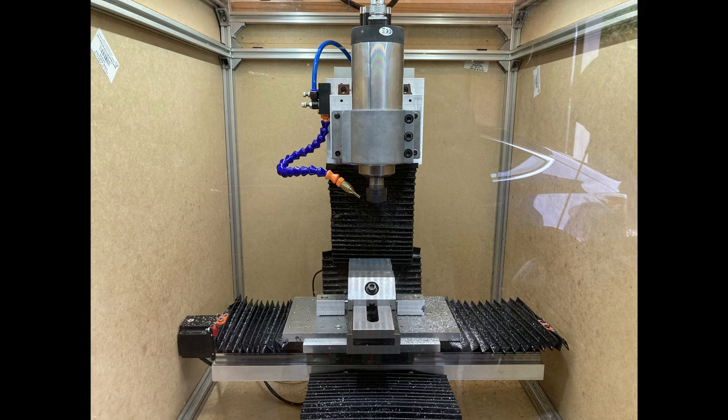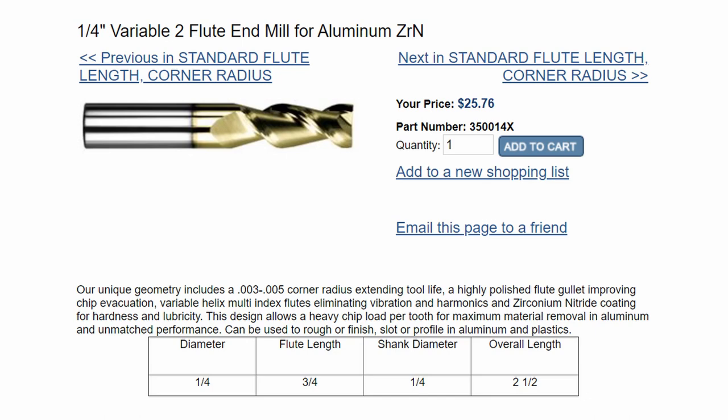I'm also evaluating these cutting fluids only for their effect on the surface finish. The tool I'm using is my quarter inch Lakeshore carbide two-flute end mill. It's made specifically for aluminum, has a ZrN coating and a very slight corner radius to improve durability. I've used a lot of different tools — single flute, three fluted, uncoated highly polished, different coatings — and this is the one that works in pretty much all situations, so that's what I want to use for this evaluation.